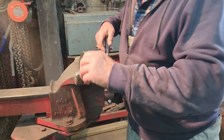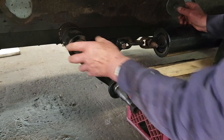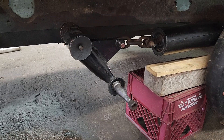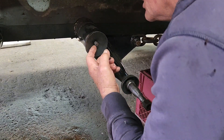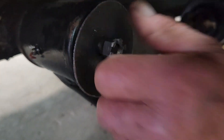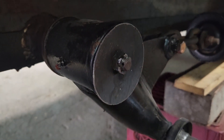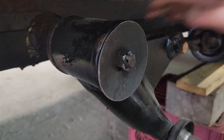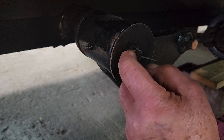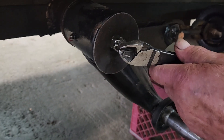We'll install this one. If you look close there's an indent there. First of all you have a collar there, and then this goes on after. Watch where the hole is - it happens to be right there. Because if you don't know where the hole for the key is, you can see that. Now it's right on - perfect. Bring me the box of cotter pins. That has to go into that slot so it can't come back.